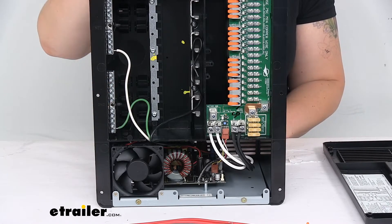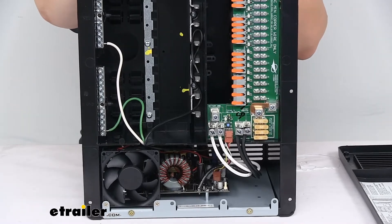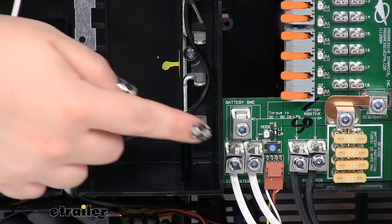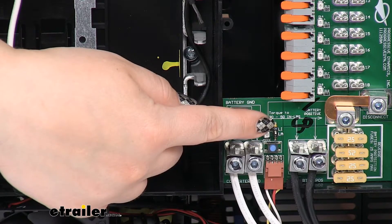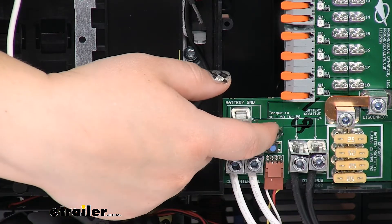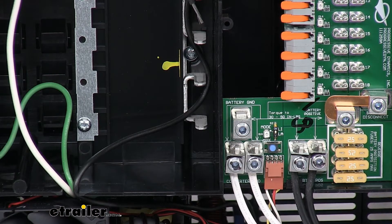As I mentioned, we will have a little bitty switch in this area here — I'm going to try to zoom in so you guys can actually see that. It's really, really small. You can see where it says 'mode' right here. Just next to that there's a little tiny 'Li' and a little tiny 'La.' Li is for lithium, La is for lead acid or really any other battery besides lithium. If you want to change it from one to the other, you're just going to flip that little tiny switch. There is a notch in the panel on the front, so if you decide to change that later on, you can still get access to that without having to take the whole panel off.